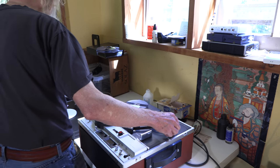And one of the things that happens with the video over time is it absorbs water into the back of the tape. Because of the backing of the tape, they didn't figure out this till about 1985. What happens is the anhydrous backing absorbs water. And so when you play the tape without doing anything to it, the backing sheds off the tape, and pretty soon you can't see anything on your video playback at all because it's all been covered over by this backing. And then you have to stop the machine and clean it up with Q-tips and alcohol.